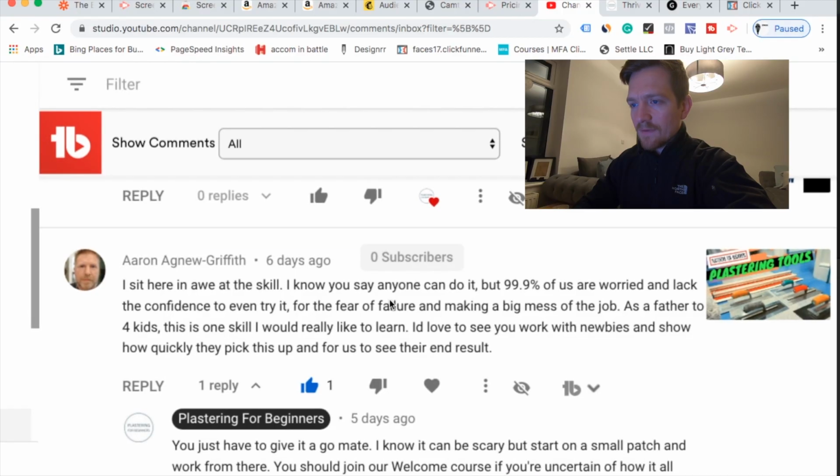But another good way is to actually throw some cement in it. If you throw some cement in with the bonding, mix it up, and depending on how much you put in, it will go off like a rocket. It makes it go off faster, but I find it also makes it a bit smoother to work with. So if you use cement with the bonding, I think that's a really good way of speeding it up, and it's probably a lot cheaper than using this Half Time stuff. So give that a go, but don't put too much in, because it will go off like a rocket, seriously. It really will.